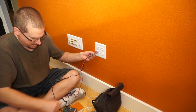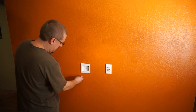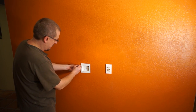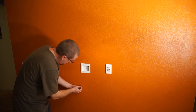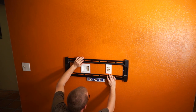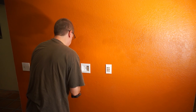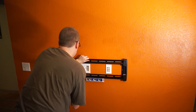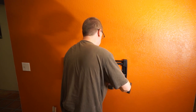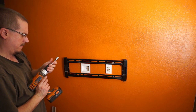With the power back on and no more maddening UPS beeping, I verified that each one registered a solid 120 volts. The custom wiring and cabling is done, so now it's time for the TV mount. I already know where the studs are, but to find the centers of them I use an old magnet left over from my days of having child-proof drawers and cabinets — magnets are by far the most reliable way of finding studs that I know of. I mark out where I can screw into the studs and position the TV mount over those positions, ensuring it's level. I pre-drill the first hole and drive in a hefty lag bolt, tightening it just enough so the frame stays in place but can still be moved slightly to re-level before marking, drilling, and driving in the second lag bolt. Both are then firmly tightened down, and the other two bolts are done in exactly the same way. When done, this mount is incredibly strong.